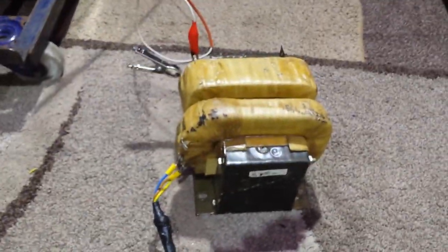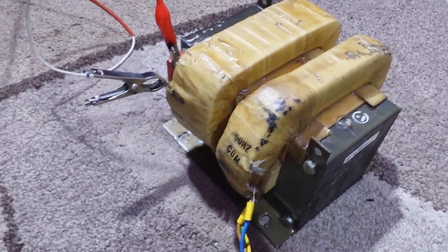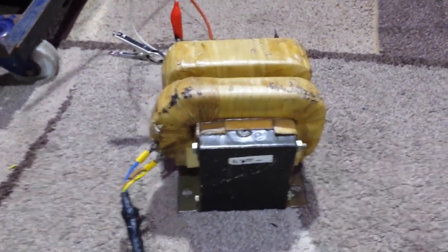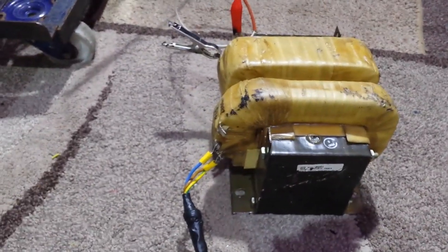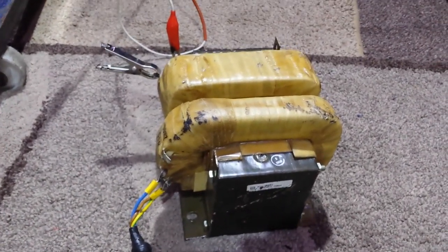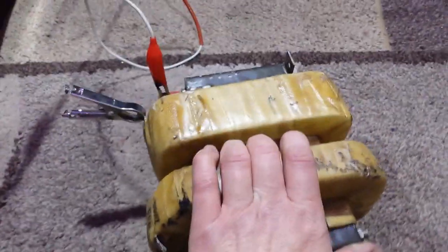I've got some more of these saved at the scrapyard. Imagine a few of those in series — or parallel — bloody hell. It certainly pulls the amps. If you tried to wire this without a ballast onto what I've done there, guys, you would draw so much current you'd blow your mains. Because even at about 40 volts I was putting into it, it was drawing 40 amps, and it just kept on going every volt you went up. So you definitely need to ballast something like this if you haven't got a nice source of 380 or 415 volts primary.